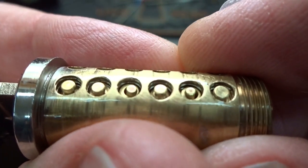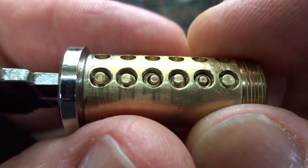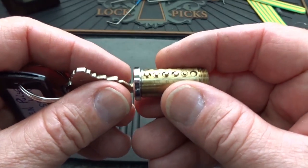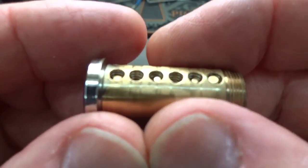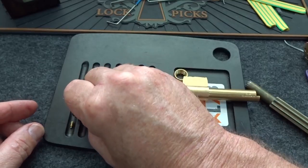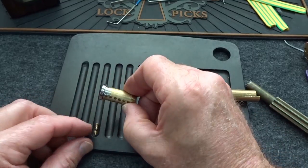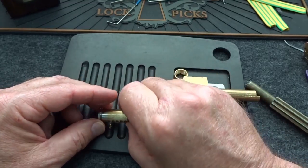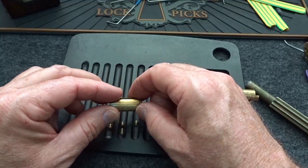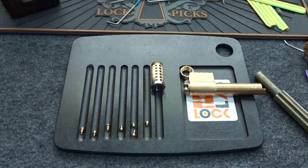In addition to these crazy cuts, it looks like we have at least two pin-in-pins — number three and number five. But with Dennis, we've got more than that. It looks like almost every one of them is going to be a pin-in-pin. Let's see if we can get that key out. Not only that, looks like Dennis has done some threading for us. That's the way it goes — sometimes you're the bug, sometimes you're the windshield. Today I'm the bug.